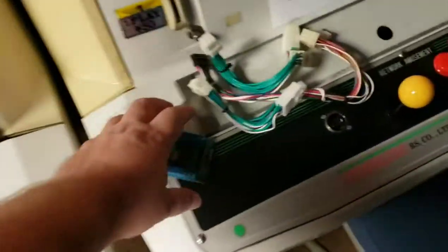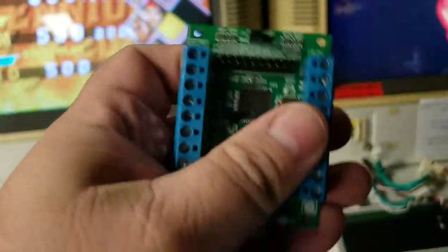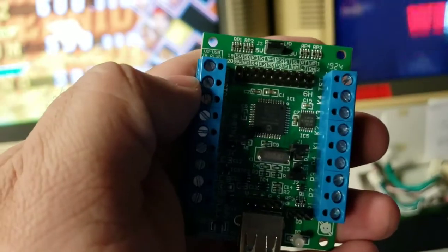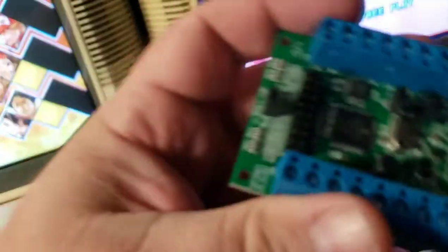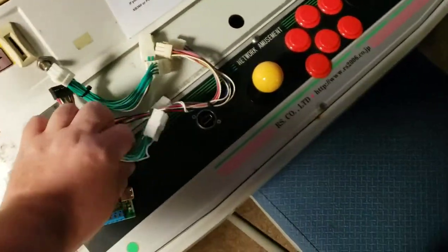This is the device — the undamned decoder. This installation would be a lot easier if you have this 20-pin header. The older versions do not have them, so you want to try to get the ones with these; it makes it a lot easier. If not, then you have to screw into these screw terminals, which are way less reliable.